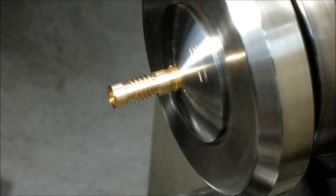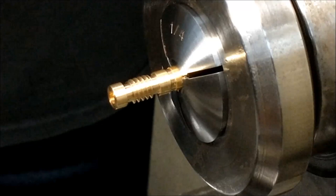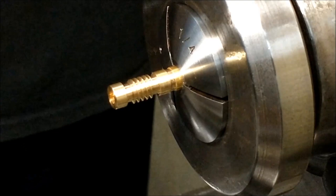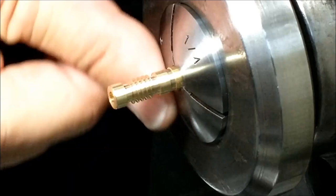Once these are adequately deburred, let's go over to the mill and broach a 1/32 keyway inside of this all the way down. I recommend doing it with a hacksaw blade, believe it or not, so jerry-rig it any which way you have to, unless you of course have a 1/32 broach with a 1/8 diameter guide, which I doubt anybody does. I know I don't. Let's pop it on the mill, figure out how to do that.